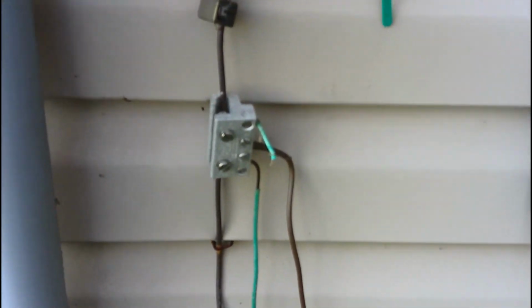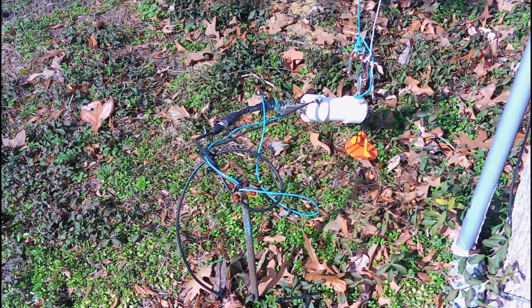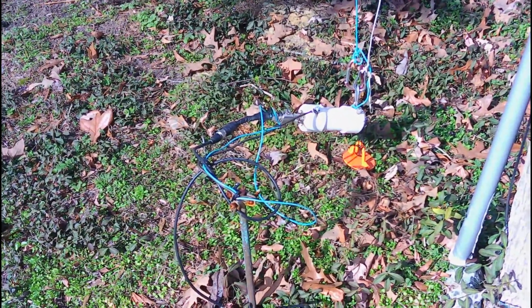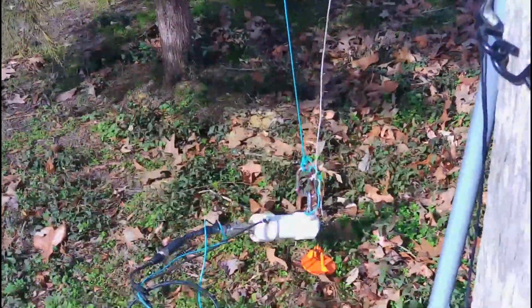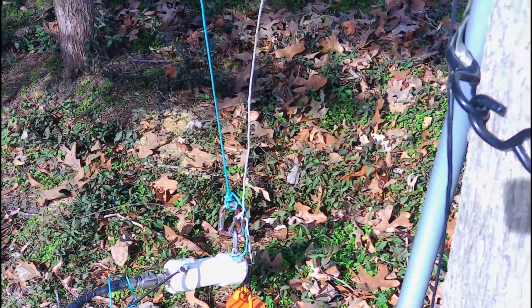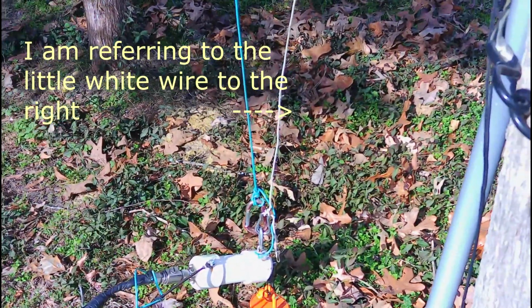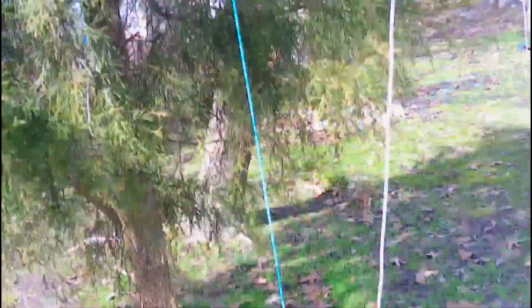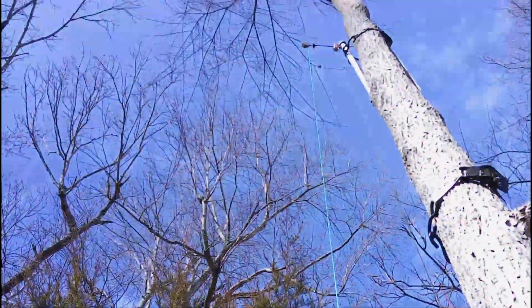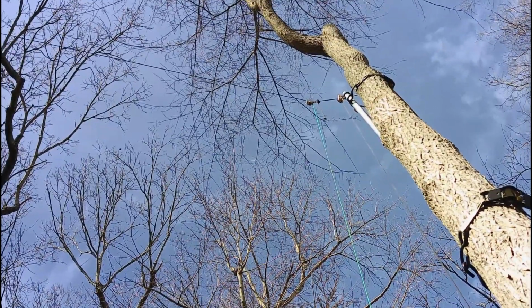So this is the installation outside. Now my antenna is an inverted L, and there's another 8-foot rod right here for the ground to that, and that still has to be connected underground with sort of like a radial ground. And then this is a 9-to-1 balun for an unbalanced antenna load, which is fine for shortwave antennas. This is just a convenience antenna which is not connected to anything right now. There's 100 feet. This goes up 20 feet, and then it's 100 feet in the southwest to northeast direction.